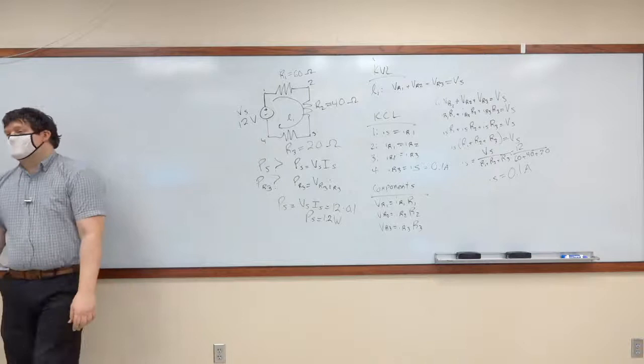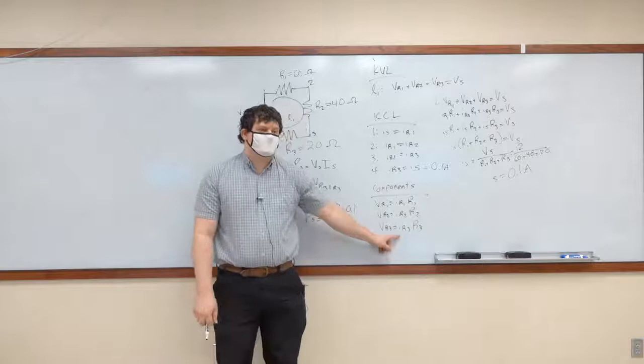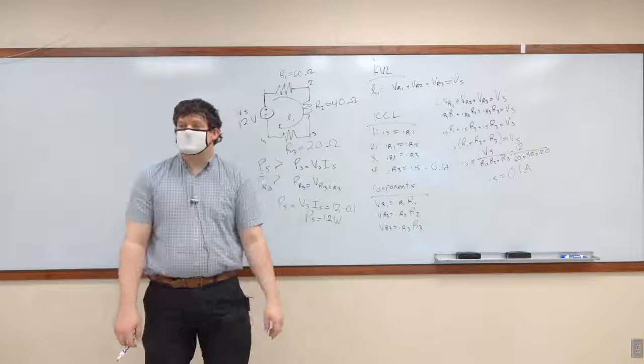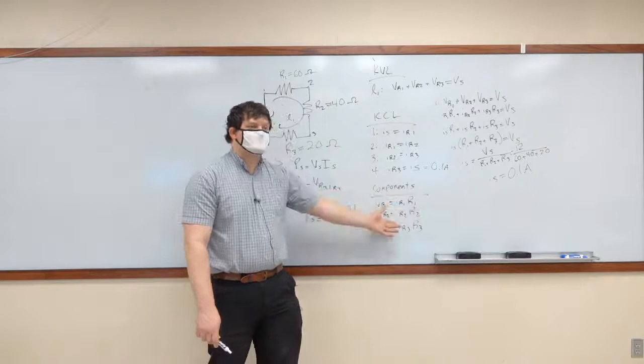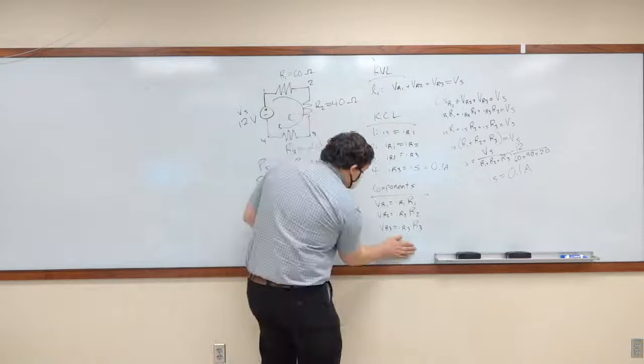All right, I'll stop asking the confusing questions. Do we know what IR3 is? Do we know what R3 is? We know what VR3 is. That's all it takes. You have to know two. We know what IR2 is. We know what R2 is. We know two components. We can figure out VR2. We know what IR1 is. We know what R1 is. We can solve for VR1. It's a good little equation.